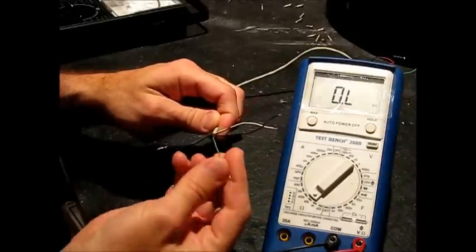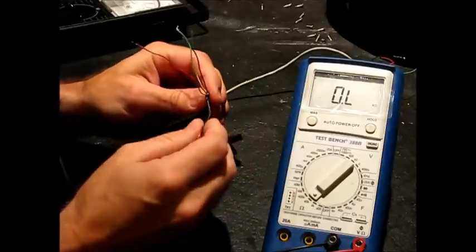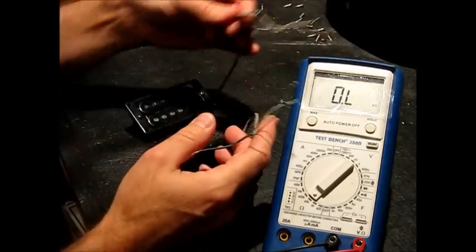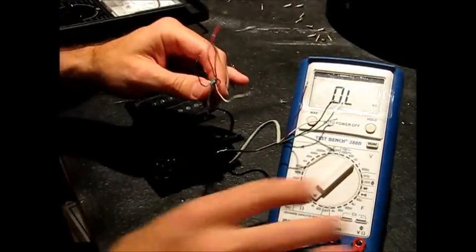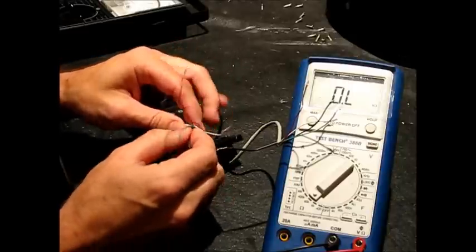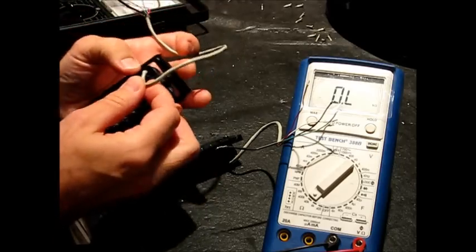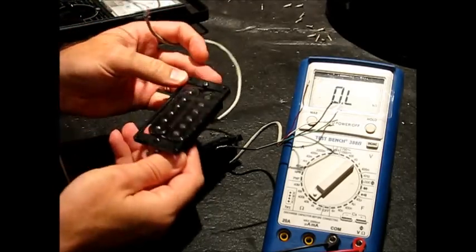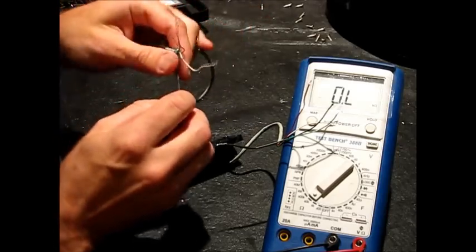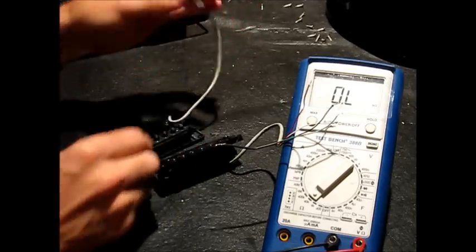The colors are black, red, white, green, and then there's a bare wire. I've put a piece of shrink wrap over the bare wire. To start with, I've got a DMM. If there's a bare wire, you can pretty much assume that's going to be a ground wire — it's going to be connected internally to the frame of the pickup. So that's always going to be ground, tied to the back of a volume pot or something of that nature.